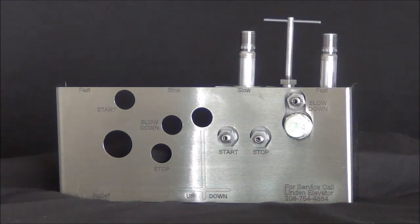But when you do face the leak down problems, the easiest test to do first — though it might not be the most likely scenario — is to turn in on the down start adjuster. That's this one right here, closest to the center bolt. We've removed everything from the valve that we just needed for this video. What we want to do is get a leak down test before we turn the down start adjuster in. Let's say we're leaking down every five seconds or re-leveling every five seconds. When we turn the down start adjuster clockwise in all the way to stop, we want to count our turns so we can put it back when the test has been completed. We'll turn the adjuster in and then compare our re-level problem.